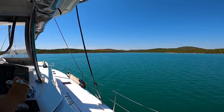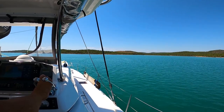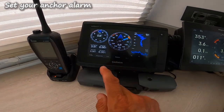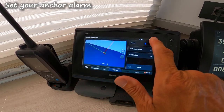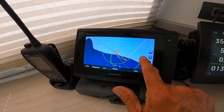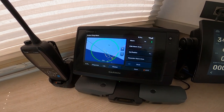Don't anchor right on top of another person if there are only two boats in the bay. It looks like we're fine. Don't rush to get to your dinghy and don't rush to get to shore — just sit here and relax for at least half an hour to make sure the environment stays the way you thought it would. If you have an anchor alarm, now is the time to set it. Go to alarms, navigation, anchor drag — switch it on. It's now centered at 75 meters. We want to edit the alarm area and move the center to where the anchor is set. Done — the center is now where we got the anchor.